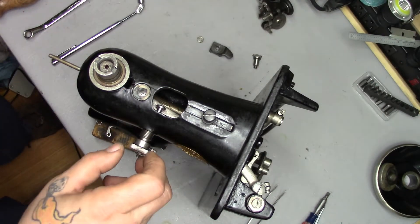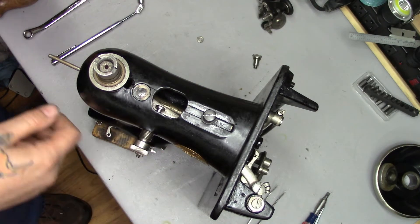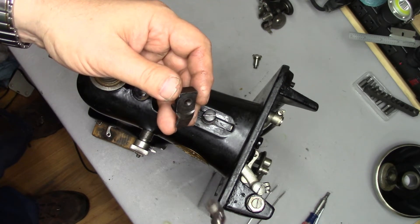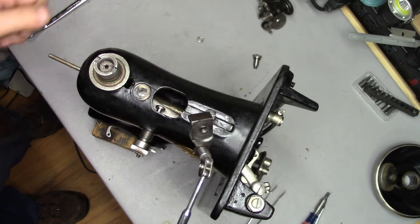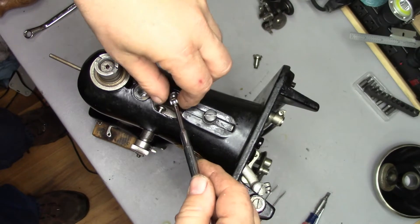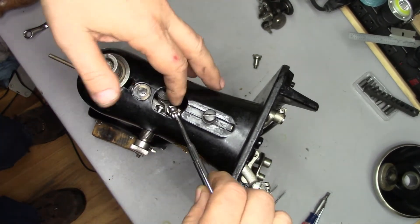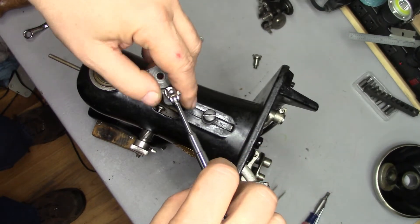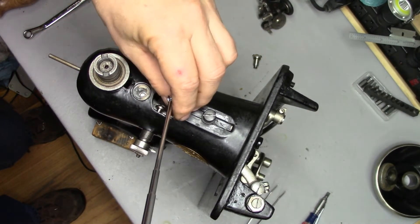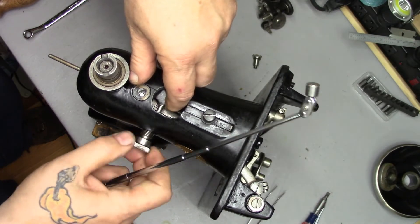That's the easy part. Now we have our screw adjuster — back that out just a little bit. What I've found works well is we take the piece of the mechanism that's the problem child, the block, magnet it like that, get her in the hole and maneuver her around a little bit. You might have to turn the shaft a little — just maneuver around and give yourself a little more meat here. Get her back in and get that pivot point back up to the block.